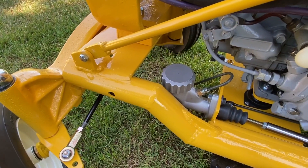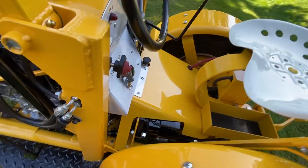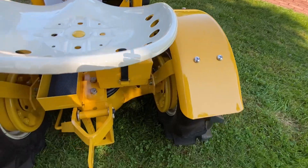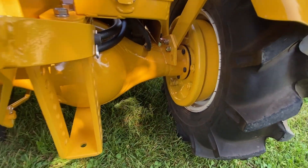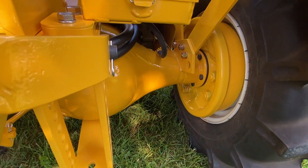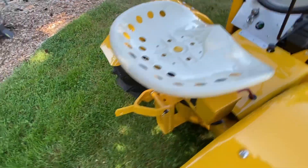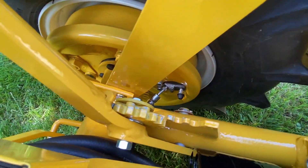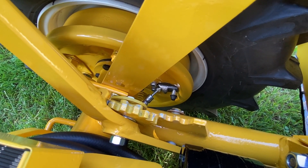I've got a dune buggy brake master cylinder, and then a single line that runs down underneath the motor here to the back and splits. Even though this is an original Panzer differential — they had mechanical brakes — it still had the brake drum and the one brake shoe from a 1954 Belvedere. But I added hydraulics, so now the brakes are hydraulically actuated, not cutting brakes anymore.